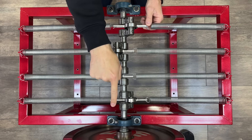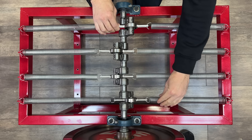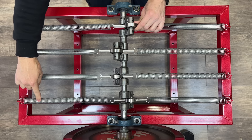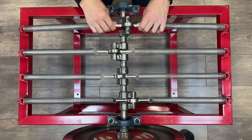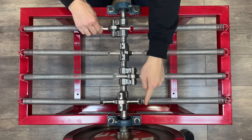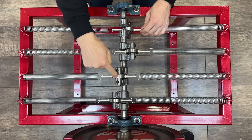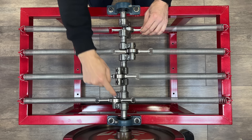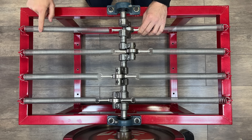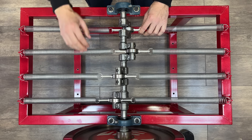When we give the wheel an initial motion, one of the springs — the one most compressed — begins to release its elastic energy while the opposite spring is storing elastic energy. As it rotates, once the spring has stored that energy, it releases it by contracting, continuing the motion. Thanks to the 90-degree offset between each crankshaft component, this motion remains continuous, driven by four parallel springs paired against another four that continuously store and release energy, sustaining the crankshaft's rotation.